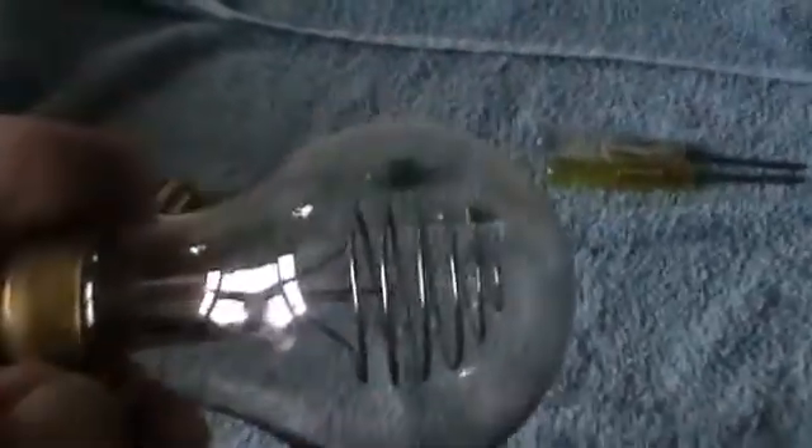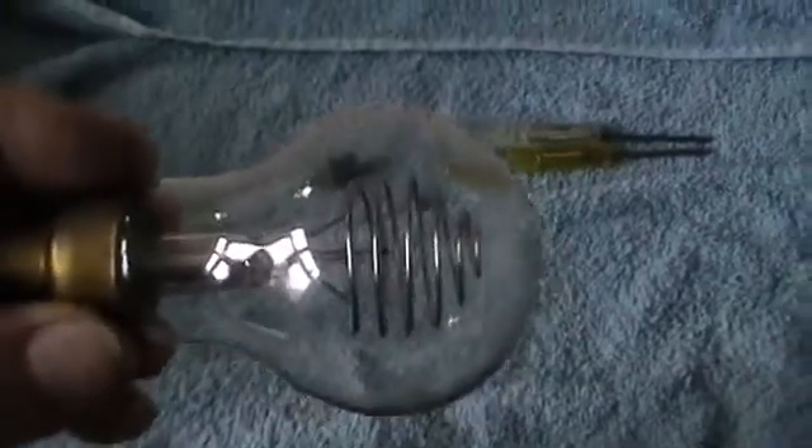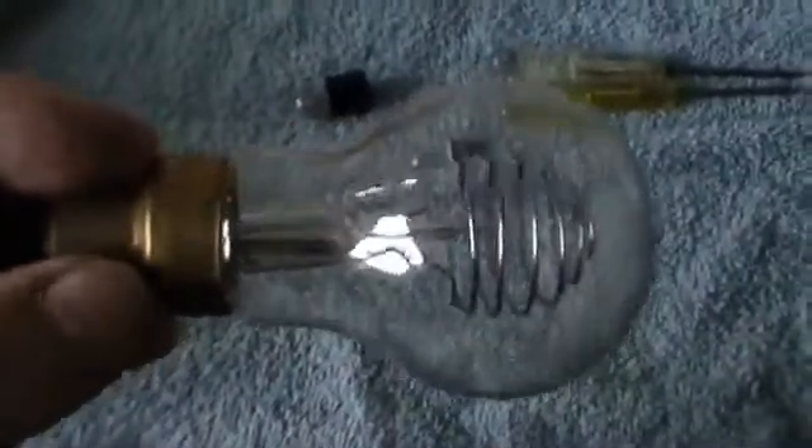These lamps were often used in the old days to test the strength of a transmitter. In the days of CB, you could hold one of these lamps near to an aerial, and when you were transmitting the lamp would glow inside - that was the space charge within the lamp. It would glow and show that the aerial was in fact radiating out. By going down the length of the aerial you could find any hot spots, because the lamp would light up brighter. Just a point of interest.